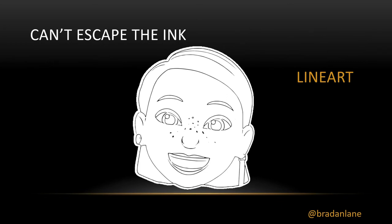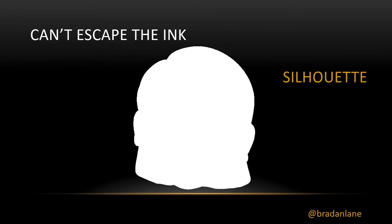You can also go simply to line art, which works well with any color printed circuit board. Line art really lends itself well if you started with something that was already black and white. And if you're using an irregular shape, you'll end up with an irregular simple add-on. What you want to do is take your artwork, enlarge it just a tiny bit, and make it a solid color. This will become a silhouette or the outline of your printed circuit board.